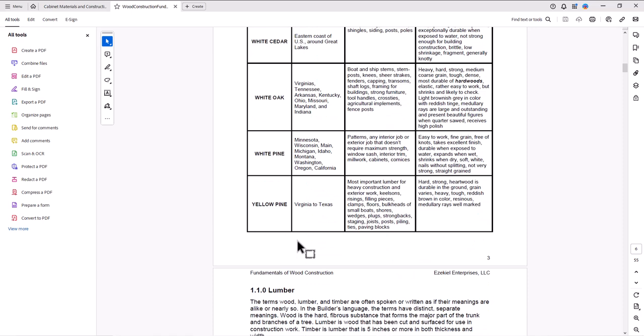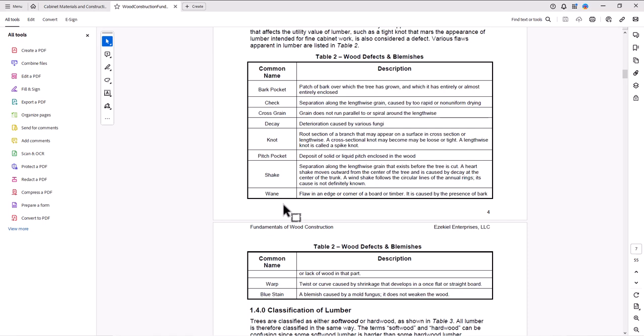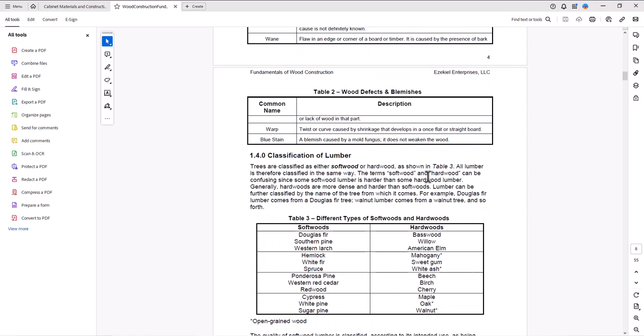The resource also covers defects and blemishes in wood, which comes in handy when talking about wood grades — sometimes we don't want any defect, and sometimes we do for a rustic look. Woods are classified into two categories: softwood or hardwood. Softwoods are typically pines — some are so soft you can press your fingernail in and indent the wood. With oak or walnut, your fingernail would never affect it. We don't typically do cabinetry with pine because cabinets get a lot of use; usually hardwoods are used in casework.